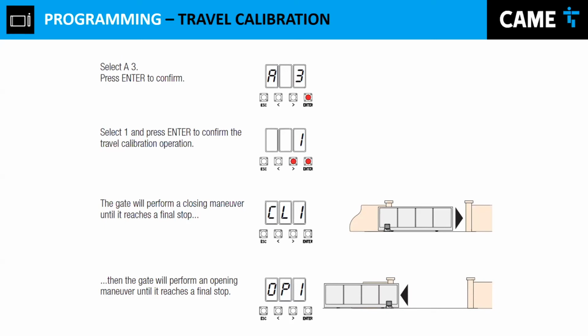Now, to do the calibration, I will go to A3. I'm pressing the left button in this case. You press, I disable it. Let me go back to F11, and then I enable the encoder, and then I have to do the calibration. That always happens when you have to calibrate the encoder. You will see those three, like, in fact, that's what happened the first time we installed the motor. So the first thing we do is go to F54. We tell the motor that our opening source is right, that's perfect. And then I go back to A3.